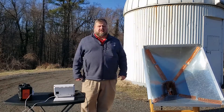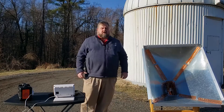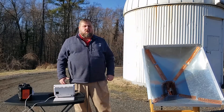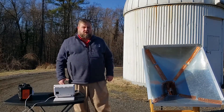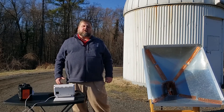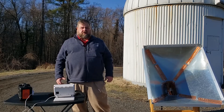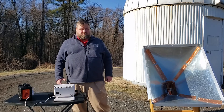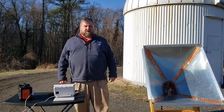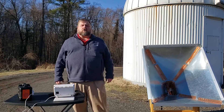If you haven't seen that video yet, I encourage you to go back and watch that one before continuing with this one. In order to process the signals we receive from the antenna, we need a digital signal processor — a software program that's able to break down the signal into various bandwidths and tell us the power being transmitted at each particular bandwidth. One of the most popular of these is called SDR Sharp, used widely in the radio astronomy community and downloadable for free.